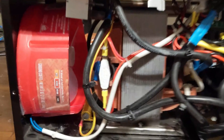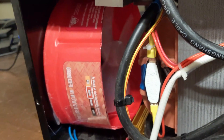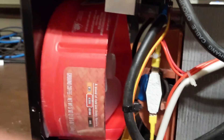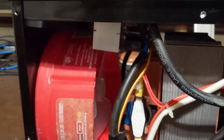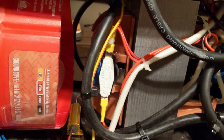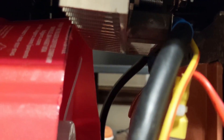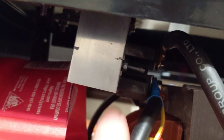Another thing I've done is use this Folgers coffee can as a fan shroud. The original arrangement had the fan in open air, which is a horrible arrangement — it just lets air recirculate and doesn't really move much air through the cabinet. With the shroud, it forces air to come in through the grill, and instead of recirculating it actually blows through the cabinet and cools the components. The things that really need cooling are the transformer — the big chunk in the middle — and the thermal cutout right there, which senses when the transformer gets too hot and shuts you down. My rectifier heat sink is just barely dipping below the top of the shroud, so hopefully the airflow will hit the heat sink and be directed up through it to keep the rectifier cool.